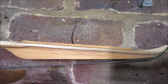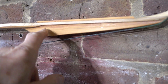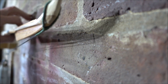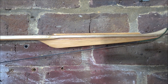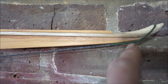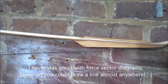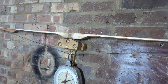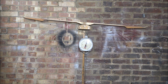I don't want to make the levers stick right out. That's quite a nice illustration of what at a casual glance looks to be ridiculously stiff — this gives you an idea of the cross section. You'd think that's not going to bend at all, but pulling the bow to 40 pounds... what am I actually pulling here? Is it 20 pounds on each limb tip? The geometry is weird with the angles and all the rest of it — it's either beyond me or I can't be bothered to work it out. Anyway, it's now a matter of getting the tiller even and trying to stay out of camera shot for a change.